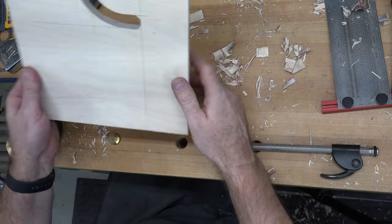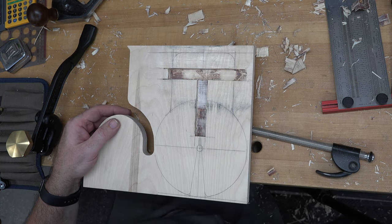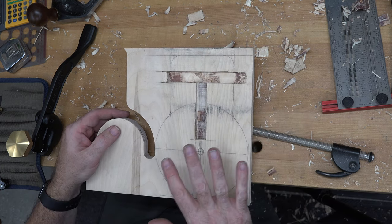Once you're done with the dados, we can take it over to the drill press. We're going to drill a half inch through hole right here in the center of our table, then take it over to the scroll saw and cut around that V-notch all the way around our table — the whole thing. This blade is feeling a little dull. It's not reacting quite the way it should to the wood. Some guys use these blades until they wouldn't cut hot butter, but if it's not cutting right, the blades are cheap — don't ruin your project, just change the blade.